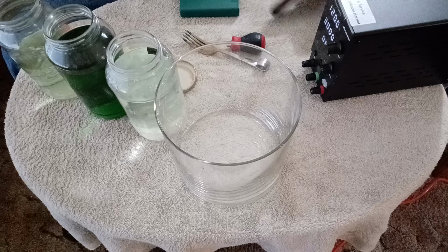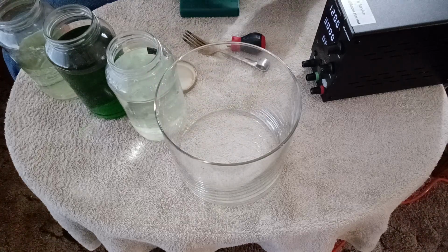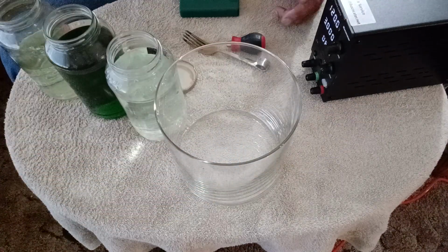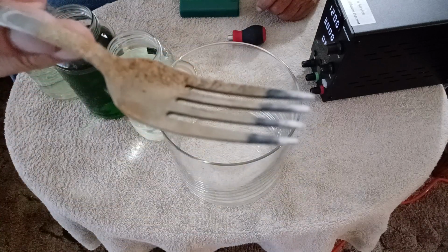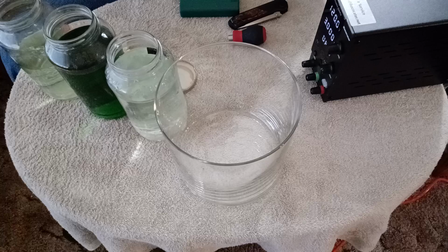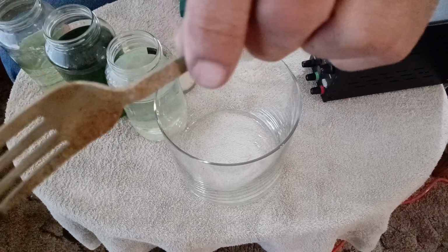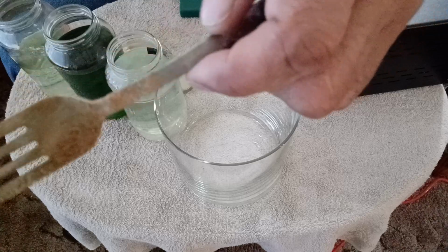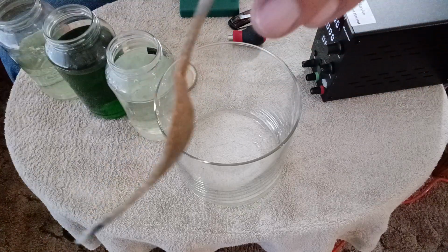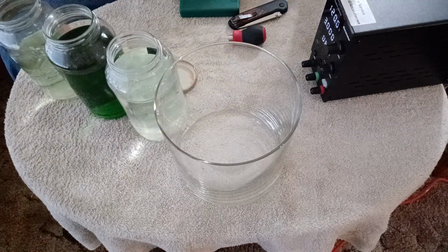Okay, to the black titanium. I'm gonna take the pocket clip off of this one and the backspacer off of this one because when I last did it, they didn't come out exactly the way I wanted. They came out with a sort of dirty finish. And that's what happens when you let your, was it anode or electrode, I can't remember the terms, people. I'm sorry, I'm not that technically savvy yet. I'm still new to this game. But this is what happens to your stainless steel ground that you put in with the fluid. It sort of gives it a corroded finish. And when it gets like this, you really need to clean it off again before you keep on trying to black anodize, because I think that's what puts a dirty finish on it.